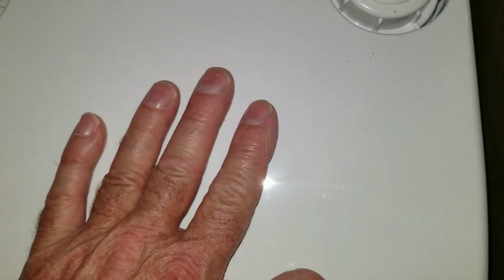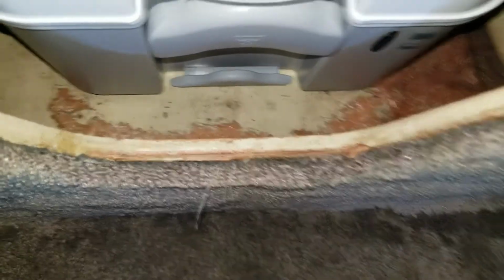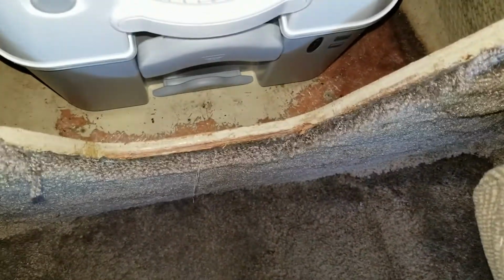Also, there's a little latch in back so you can pull off the clear water tank on top, and make sure you can open the lid. So that's probably where I'm going to place mine. So I got plenty of room. I can get my fingers down in there, and I can open the latch, and the lid still opens. And then once you've got the place that you like it, you have to mark the front of the toilet. So once it's in a place you like, go down there with a Sharpie and mark it, because there's going to be a template you use down there to drill your mounting holes.